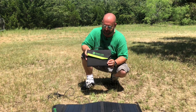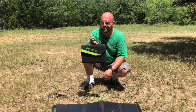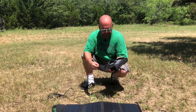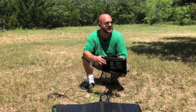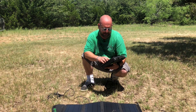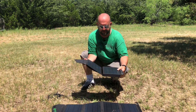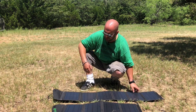The 40-watt version is very much the same. It's a little bit heavier because it adds two more panels, but it also has a nice handle. Same zipper bag in the back so you can keep your cordage and miscellaneous things. Same USB, same barrel connector, same daisy-chain capability. This one is rated at a max output of 2.22 amps — a little bit more power. As we unfold it, it's the same idea except longer, with two more panels.